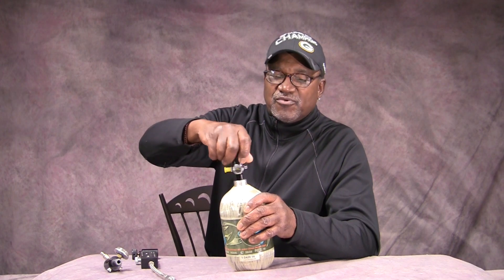I tried to find a video on how to take the regulated system out of here, couldn't find one, and decided not to mess with it. When you're dealing with 1,500 PSI you really don't want to play around with stuff you don't know. So I just made the purchase. Now it's as simple as this: I've already loosened the old regulator and it screws out. It has an O-ring on it to ensure no leaks — you want to test for leaks anyway once you're done. Take that one out, take the new one, and pop it in. Torque it down.